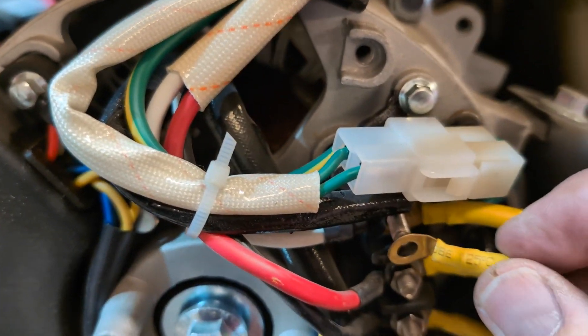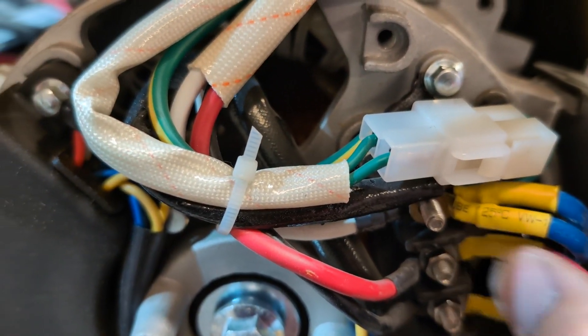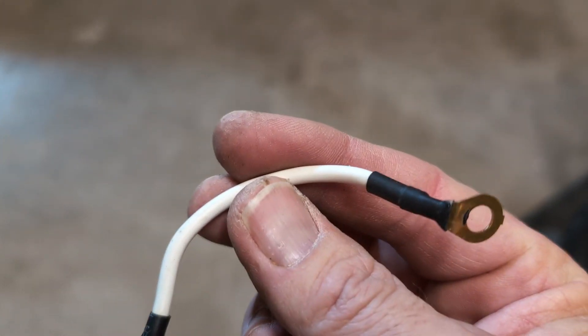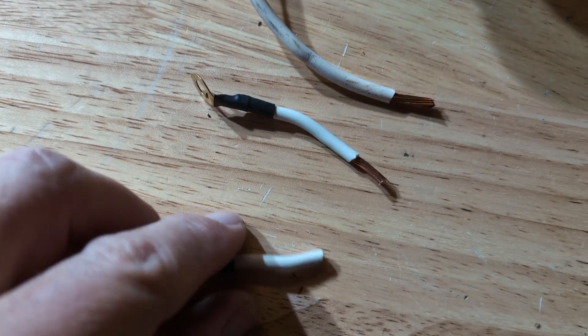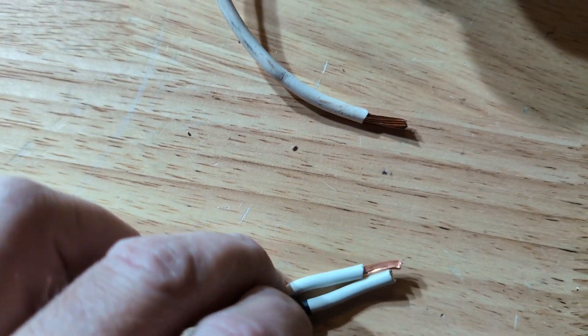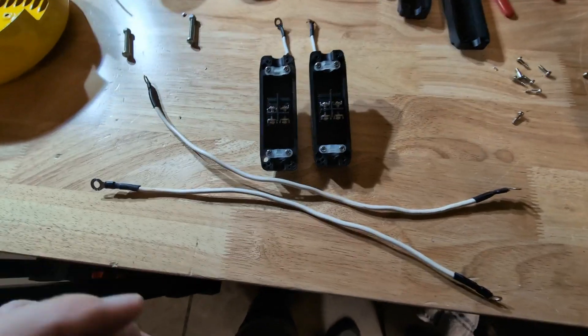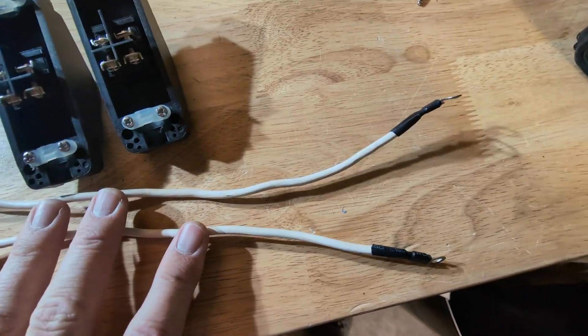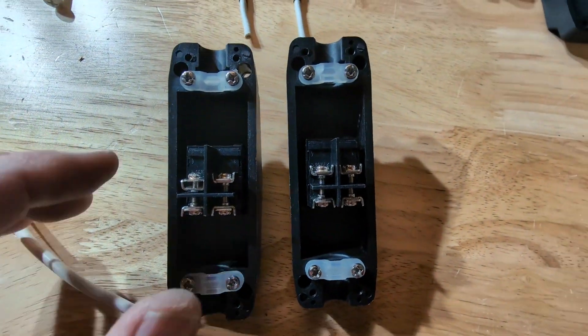This yellow wire you can go ahead and put back on there. Here's our wire — let's check the gauge on it. I just cut this in half; this measures as 12 gauge, but the one that came off the generator is 10 gauge. I've got the wires made — 10 gauge, crimped and heat shrunk.